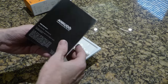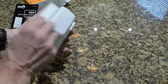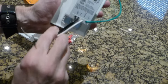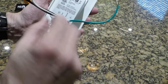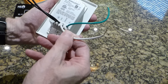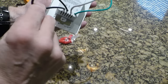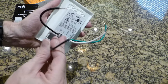If you've installed electronics before in your home, it'll probably be enough — hopefully this video will give you a little bit more information. It also shows you how to set up your Wi-Fi, which we'll talk about later. On the back of the switch, you'll notice there are four wires marked on the unit itself: a ground, a neutral wire — which is mandatory for installing this system — and a live wire and another power wire. These can both be installed to your black power cable in the wall, and they're interchangeable. Both need to be installed.